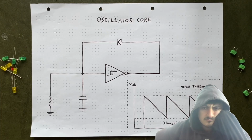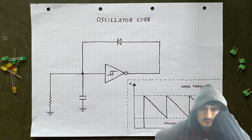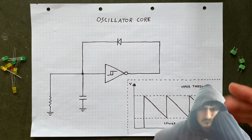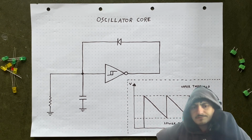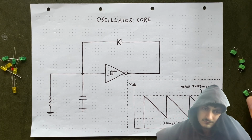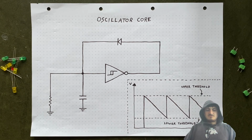So which route do we take? Changing the capacitance or changing the resistance? To be honest, that's pretty much a non-choice for two reasons. Reason one is that increasing the capacitance not only changes the second phase, but also the first phase of a wave along with it. If the capacitor is big enough, charging it will take more and more time, until our wave morphs into a weird triangular shape. Let's check it out by installing a really big capacitor.